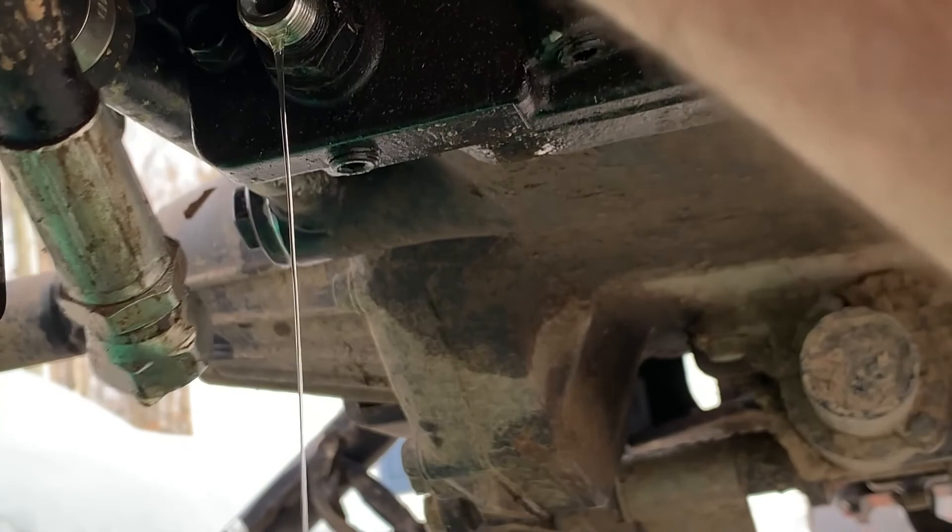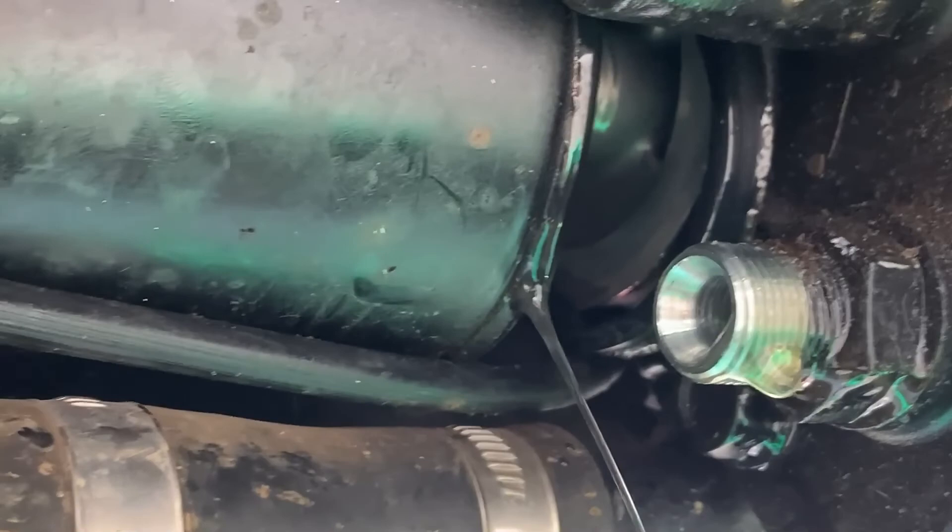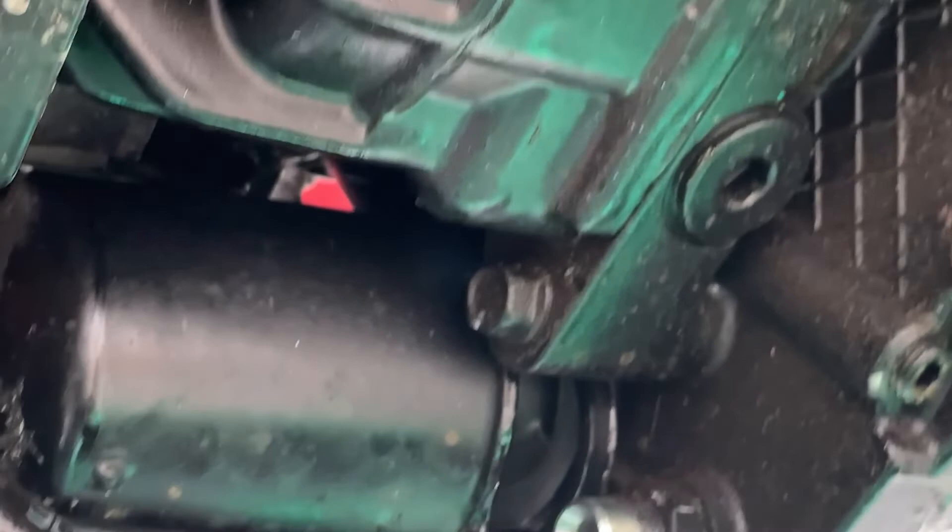So after several turns with the wrench, now I can just hand it off — there it goes, it's taken off. The filter's just draining, but you can just get in there with it. Free spin it, and then once I get it out of here, I'll come back when I get the new one. I got it free — just taking the time with my hand. Just like a car, it's going to be full of hydraulic fluid instead of oil. It starts to drain out of here as the pressure comes off. Have your drip pan wherever you need it to comfortably do the work.